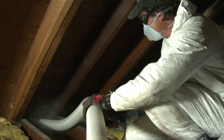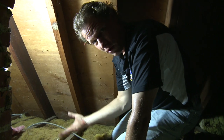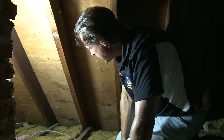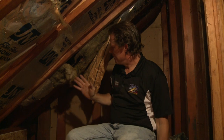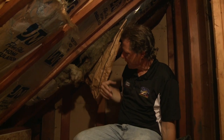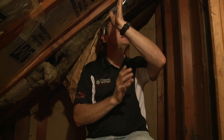Capes typically have knee wall spaces. When we insulate this attic with cellulose, we're going to stick our hose down each rafter bay to insulate it so the cellulose doesn't fall into the knee wall space, which could be used for storage. Let me show you the knee wall space as it is now. This insulation represented the thermal boundary of the top of the house — this space is heated and this is where we want the heat to stop. But you can see all the dirt in this insulation, representing all the airflow that has been leaking out of the house. This is a cape and it doesn't have soffit vents, but there is some leakage around the fascia board. This insulation is poor defense against air leakage, either through the insulation and up into the vented attic or from any leakage around the fascia.